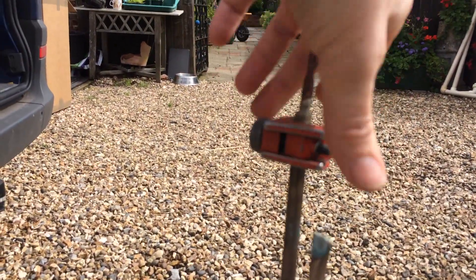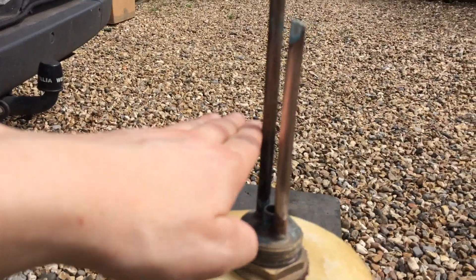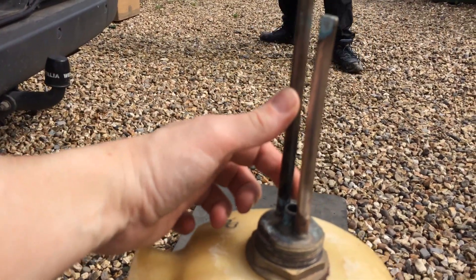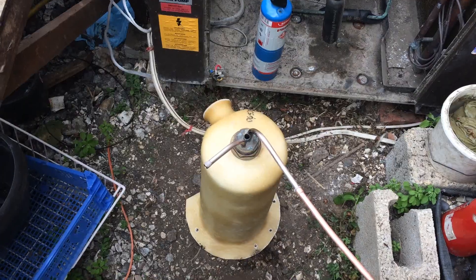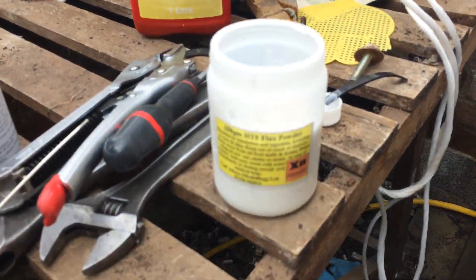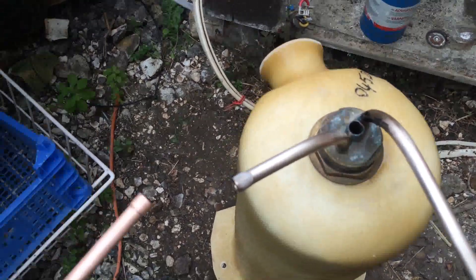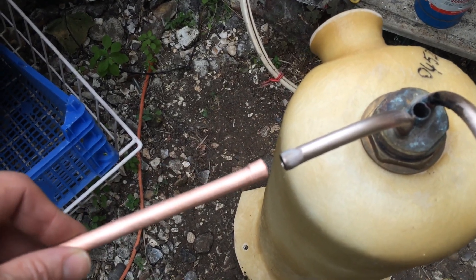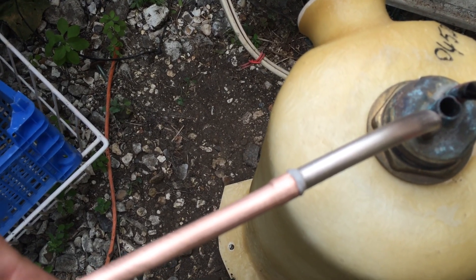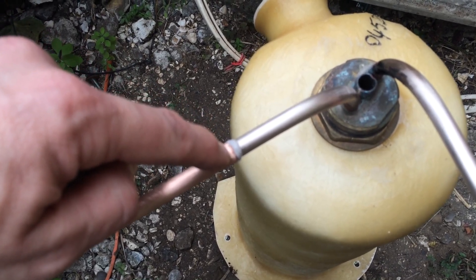That hissed a bit so we've got some pressure in there. We've got to bend these — they're too high, the top of the unit's only about here. These are stainless so I'm hoping we can bend them by hand. I've got the tubes bent over. We've mixed some special flux up with water and put some on the end of the tube — if you just try and use it dry it doesn't work very well. As soon as you put the torch on, it fluxes off. So we'll put that on and make sure there's flux properly on the copper.